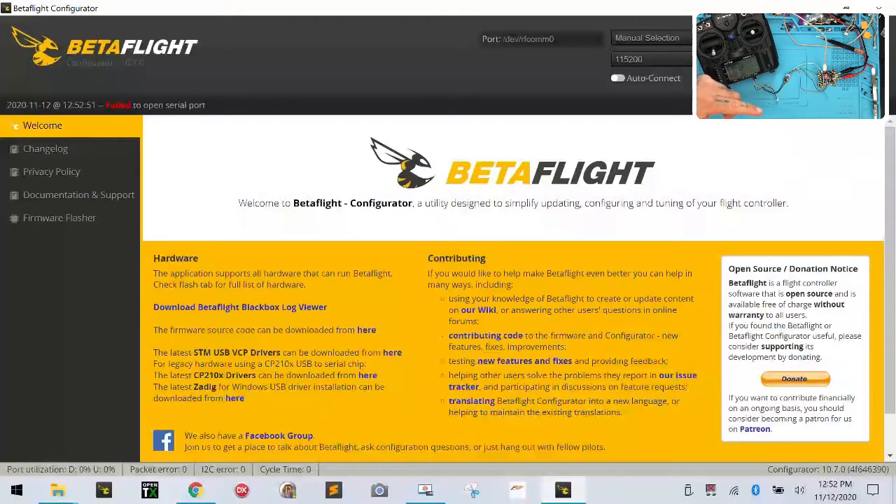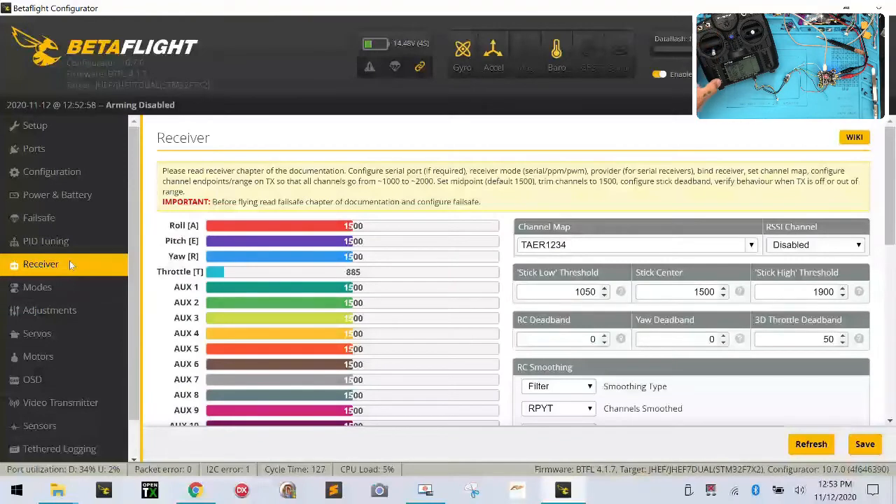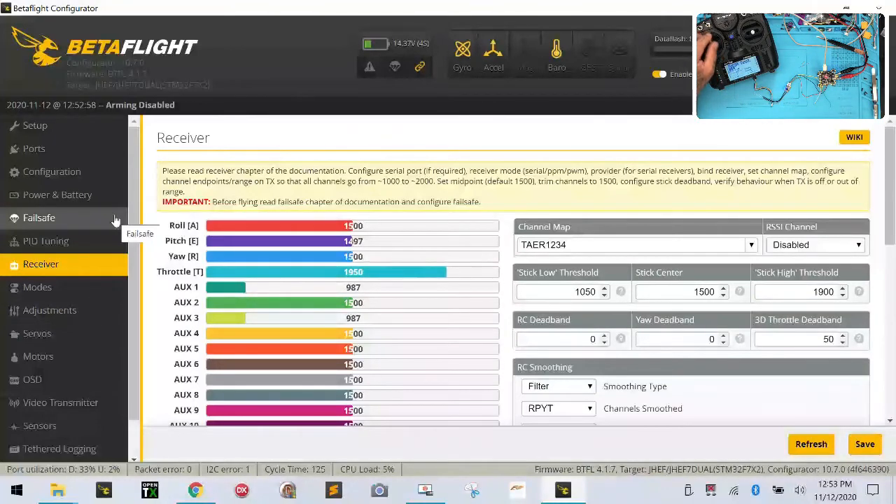Let's connect again, wait for it to boot up, and see if we still maintain our connection. Let's go to receiver. With this, we've now lost our receiver. We're still getting telemetry, but we've lost our ability to control the unit at all. So we're going to hold the button down — one, two, three, four, five — let go, and it switches back. There we go. Now we have our radio back. So to note: even though we're using the S port to use F port, the blue light state for SBUS or CPPM still has an effect here. Keep that in mind.